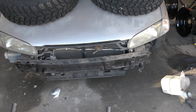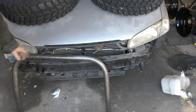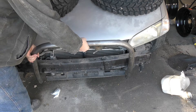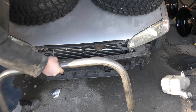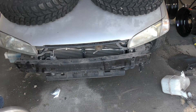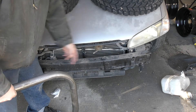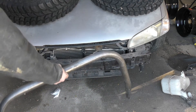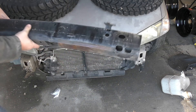This is the stock bumper section, and what I'm going to do is take this bar I just bent and countersink it directly into this front section, kind of hanging around like this. This will give us a little bit of a ramp bar, and we'll already have all of our mounts made. Then once we get that welded up and reinforced, I'll cut out the whole center section because we need room for stuff in the grill area. So I'm going to take this over to the bench and we'll get slicing and fitting.